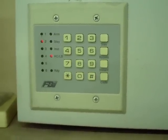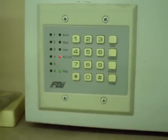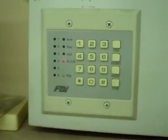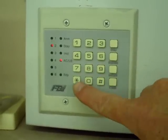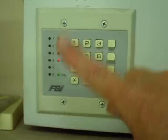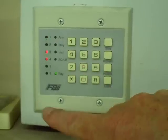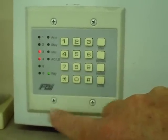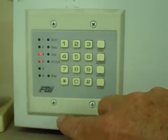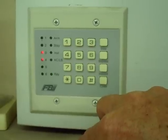Question 12 is the location we have to change — that's the siren setting, whether it's 12 volts or using the driver. It's location 2 within that question, which has four locations total. To get there, push the star button, then the installer code 2468, push the number 1 button, then star, 1, 2 to get to question 12. Push the pound button to move to the second part of question 12, then enter 0 to change it from 1, making it a 12-volt output.